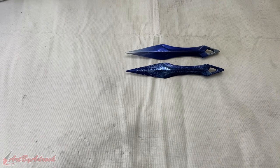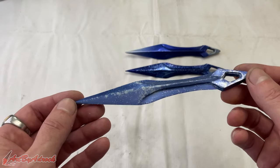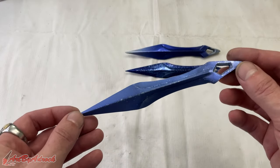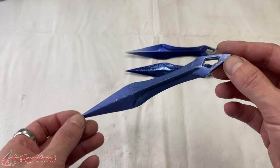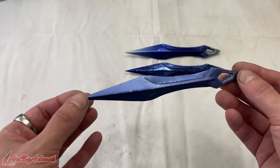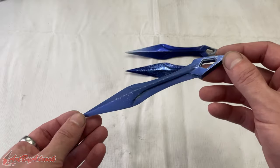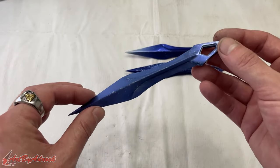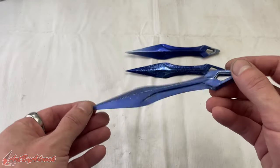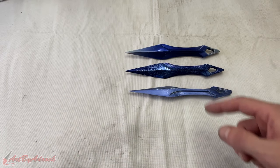I did one other one — this one is slightly better but it's lighter. This side probably didn't get anodized as well because it was up against the wall. You really want to have your part more or less right in the middle of the bucket. Using some air assist or bubbles to agitate the acid a little bit more would help so it etches the whole piece evenly, not just one side. My dye may have gotten a little weaker, which is also why it's not as dark.